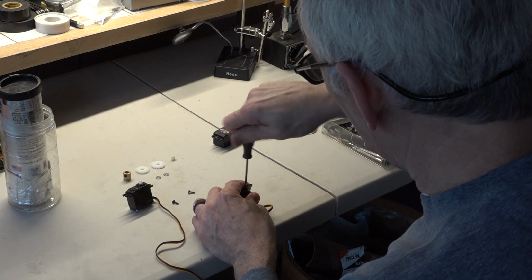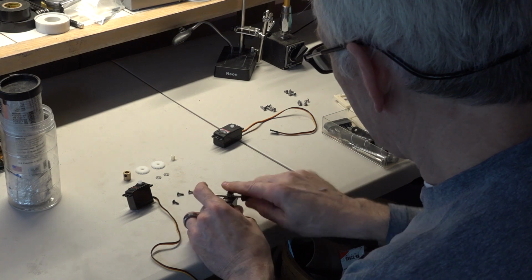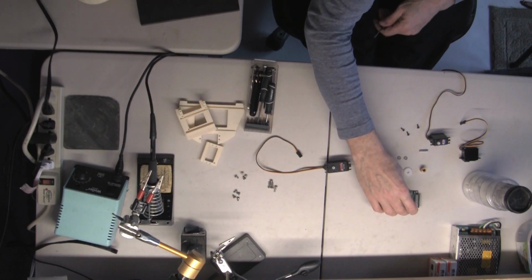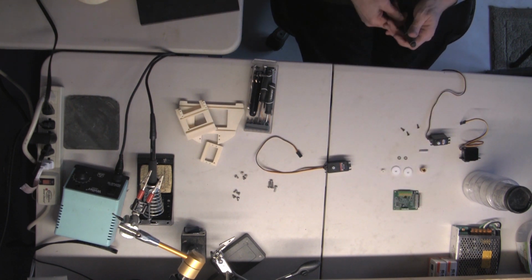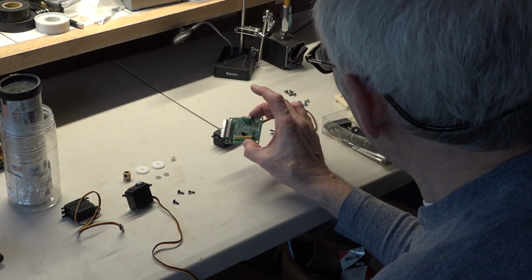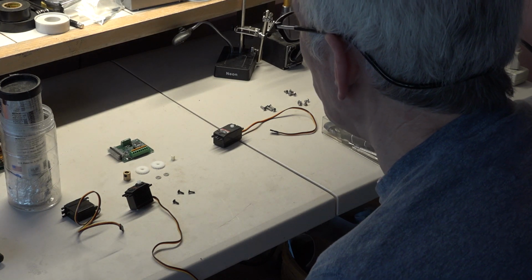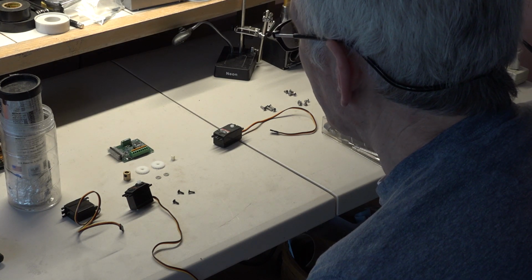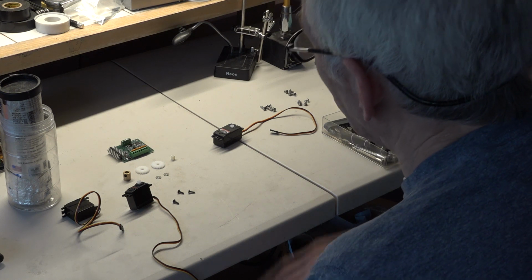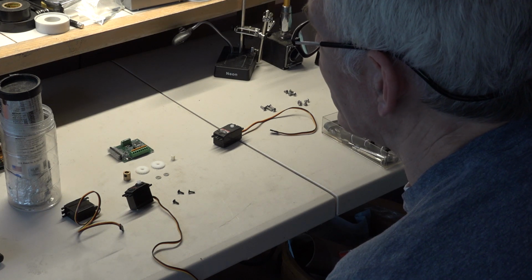Now, the one thing I didn't mention that we will definitely need in this part is the controller card. And in order to get that controller card right, we're also going to have to do the wiring. We're going to do another section that says how to wire this up. And we have the wire. I've got to measure it out. We usually use 6-foot lengths of the power wire and 6-foot lengths for the input and output of the DMX.